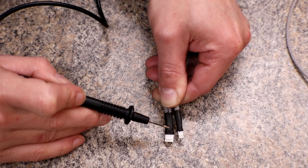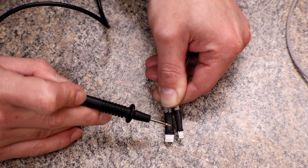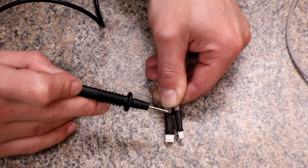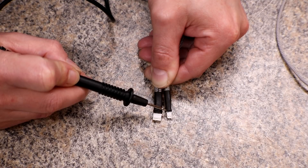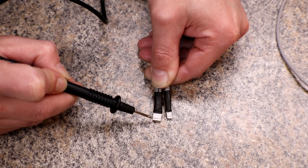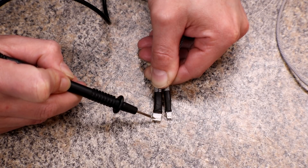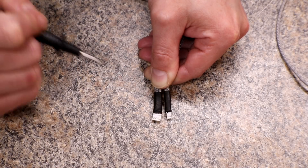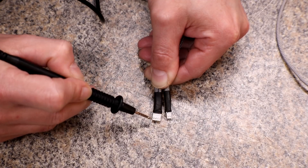These are the connectors from pack one, and this is an extension wire that I made. This one goes from pack one, or LongMon one, all the way down to the WatchMon — it's a direct link, the first connection. I have the little black mark here which would be the blue wire, and the blue wire also connects to this pin on the four-pin connector. The very next pin over would be the yellow wire. I'm going to be checking those two wires on all the packs.